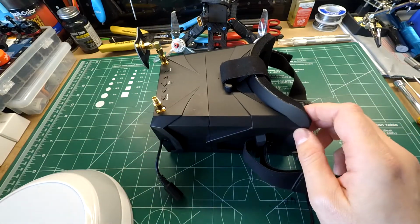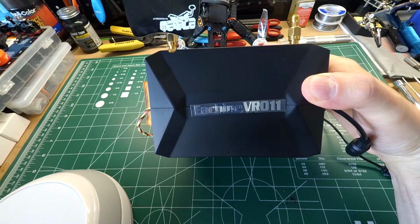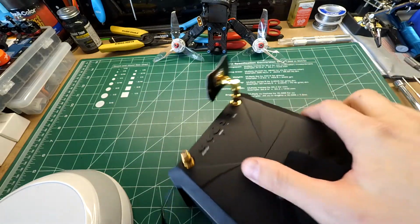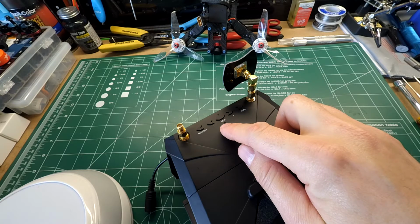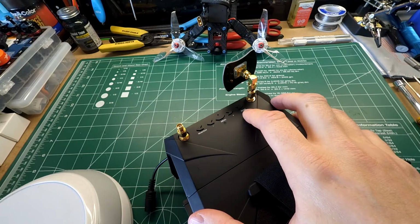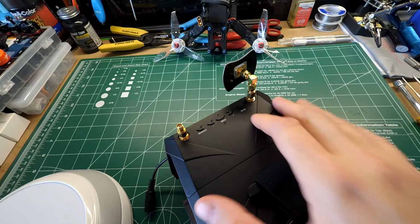What these goggles do feature though is a good OSD that lets you know your working battery voltage and RSSI, and of course it's got a good channel scan button menu. You can adjust brightness, contrast, pretty much anything in there. PAL, NTSC. You can calibrate your RSSI and do all kinds of crazy features and functions with it. And the scan, I found out, is pretty accurate. It always lands right on my channel that I use, 5860, and I've tried that about 5 times and it lands on it pretty accurately.